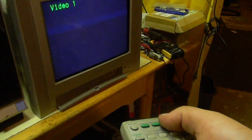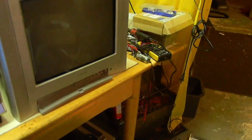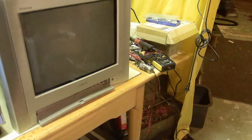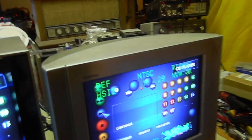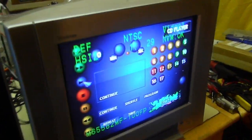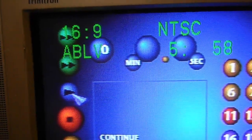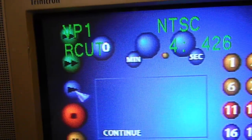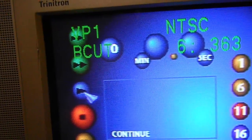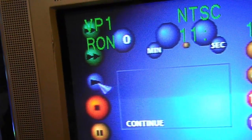Alright, let's give her a go. Power off, display, 5, volume plus, power on. And we're in. Let's do some service menu stuff. I haven't really explored this before. There's some very useful stuff in here. So look, we got a red drive, green drive, blue drive, red cutoff, green cutoff, blue cutoff, S-con, S-hue, S-col, S-bright, S...